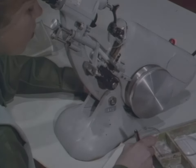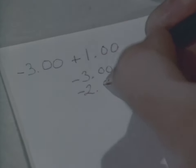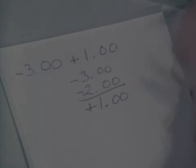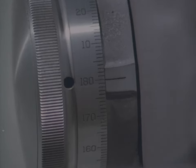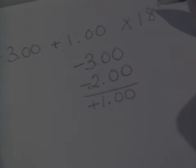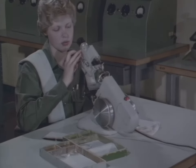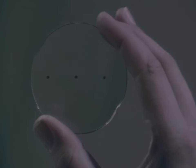Another way to figure this is the method you've been using in class. Remember, you are not adding and subtracting numbers as usual — you are just finding the distance between the first and second readings. Note the axis dial setting: 180 degrees. Write it down as it would appear on the prescription. You've now finished neutralizing the lens. All that remains is to spot and mark it. You do not wipe off the outer dots since they mark the 180th meridian.